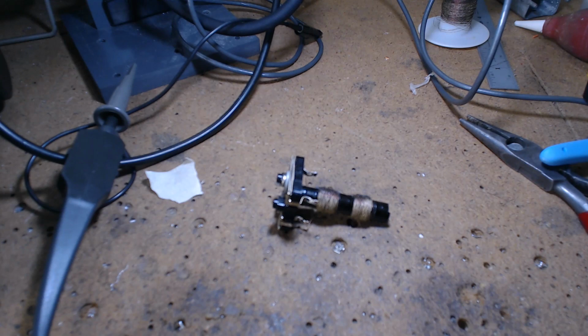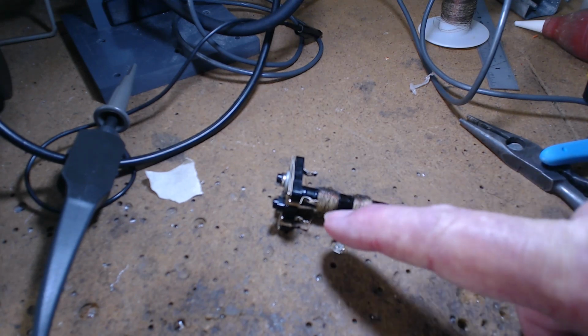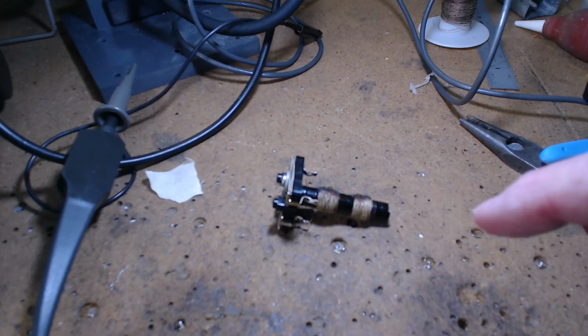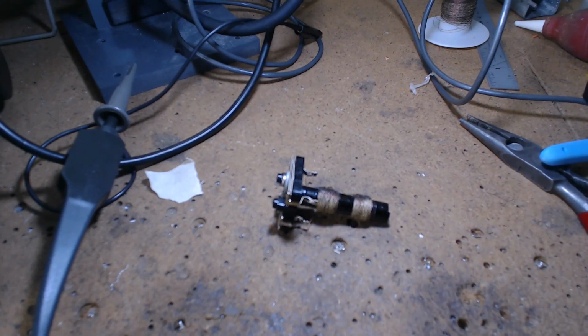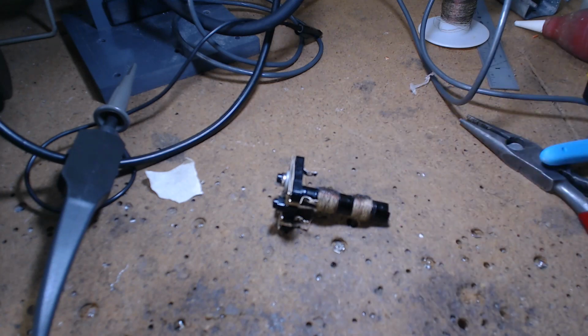You know, when I opened that radio up and saw that IF can, and I'm going, oh, don't do this to me. I am tired of winding coils. Oh, and this coil isn't doped. What you see on there is silicone caulking. So I can unravel the coil. I can take some turns off it. I only put a thin stripe of silicone caulking so it won't unravel. But if I have to, I can pull the wire back through the silicone caulking and take turns off.